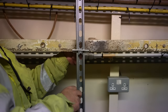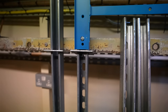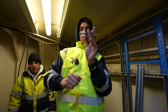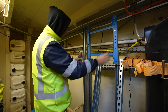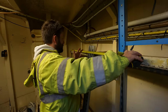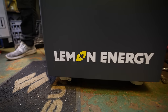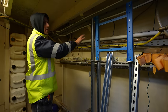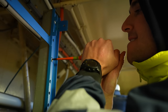The plan is we've got these Unistrut window brackets and what they do is they work by friction. The Unistrut goes through that hole, then that screws in and that will hold everything steady and in place. So that inverter is going to mount there. Then we're going to have these 41mm Unistrut pieces going down, then we'll have some 21mm Unistrut going across and then all of our trunking — some metal trunking mounted here. The batteries will go underneath and then we'll have all of the controls and everything else up here for the Lynx distributor. It should be quite a cool little setup.